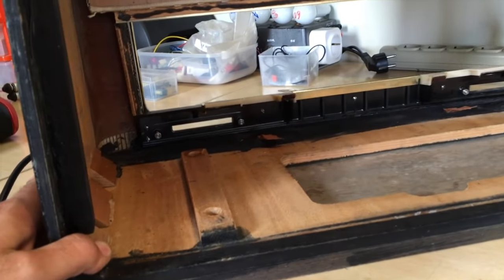The knobs have been cleaned up quite nicely — they're all in pretty good shape. The FM1 has a slight crack in it, but it's been cleaned up as well. Whoever owned this had a similar idea about using it for FM. I'm pondering whether to do an IF alignment — I think what I'm going to do next is try it out, see if it's off by any significant amount. If it is, I'll go through the alignment. The problem is all the alignment instructions are in German in a very badly scanned PDF, so it's not easy to OCR and translate. But it's nearly there.